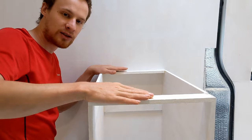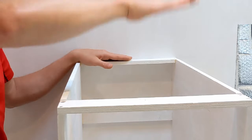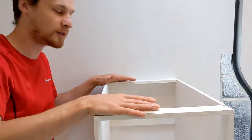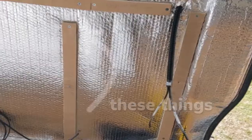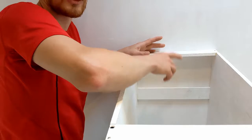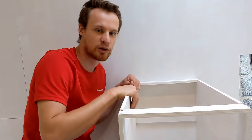These strips we've put in not only give it a bit of extra support, but it means when we come to put the worktop on top we can screw up through those horizontal ones to secure the worktop. The ones running down the back we've tried to line up with the battens from when we did the battening before we put the walls on, so we can screw through those into the wall and hopefully into those battens behind to attach it really nicely.